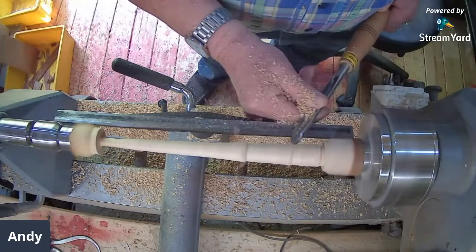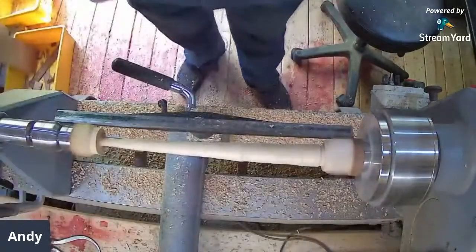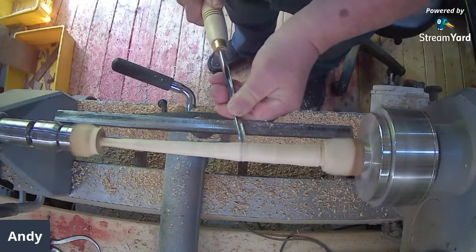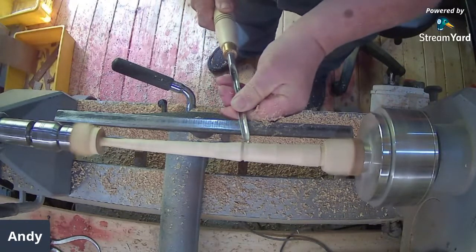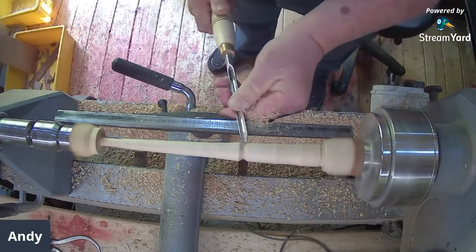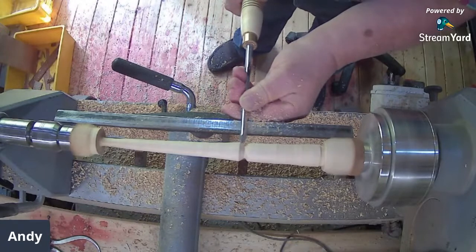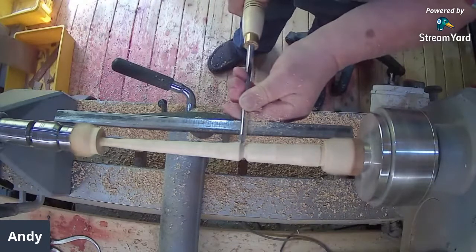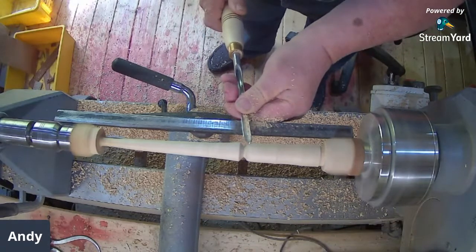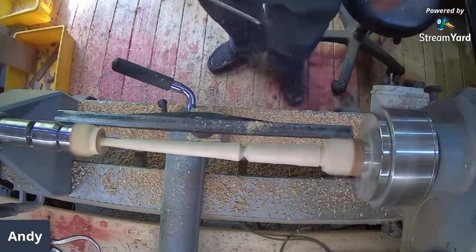Sweet chestnut is quite an aggressive wood on the tools — it won't take long to take an edge off. It's a bit like ash. There are two really important parts of doing one of these, and this intersection between the blade and the handle is one of them. If you don't take this down far enough it looks a real mess. It's got to go down to basically the thickness of the blade, which is going to be somewhere around 6mm. So immediately I'm putting a weakness into it, but you have to have it there to tell you where to stop.